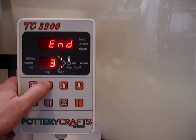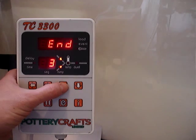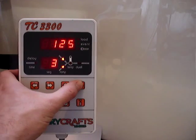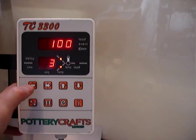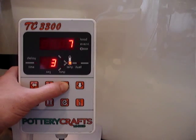If you press the arrow to the right, it currently says end. If we wanted to put a cooling speed in, we hold the up button and we can now program it — let's do 100 degrees an hour. You'll notice that the longer you hold your finger down, the quicker it scrolls, which is why I overshot. So we've now got 100 degrees an hour, and we want it to cool from 1100 at 100 degrees an hour down to 400.